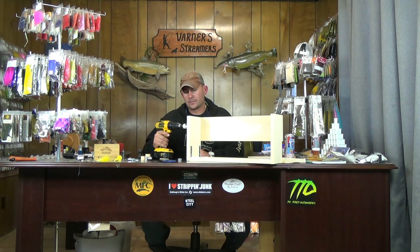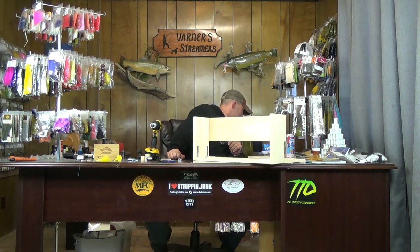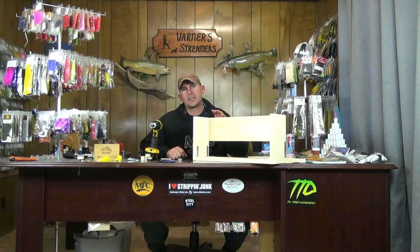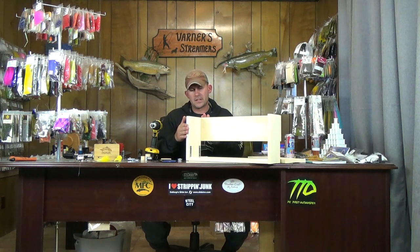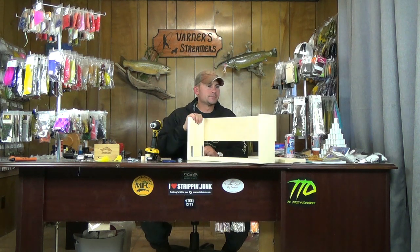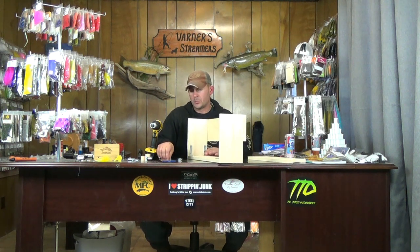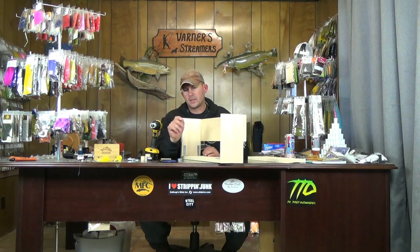When running this I want the working height to be at the exact height that the drill bit sits at, so it's just sitting right on the bench and I don't have to worry about balancing the bit — I just squeeze the trigger and we're good. For the 1-1/8 inch hole, it's going to be two and nine-sixteenths from the working side. I drill that hole, and that's going to be the rotational portion of the dubbing brush.